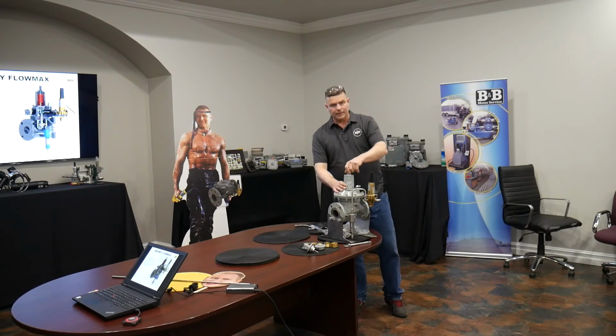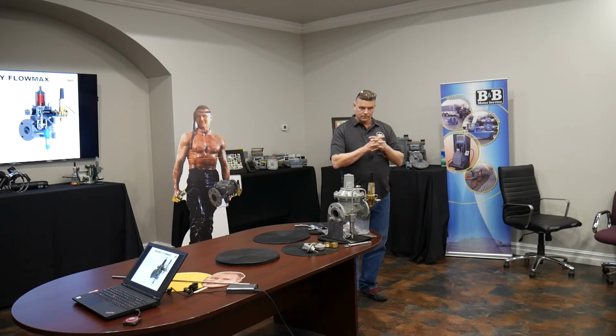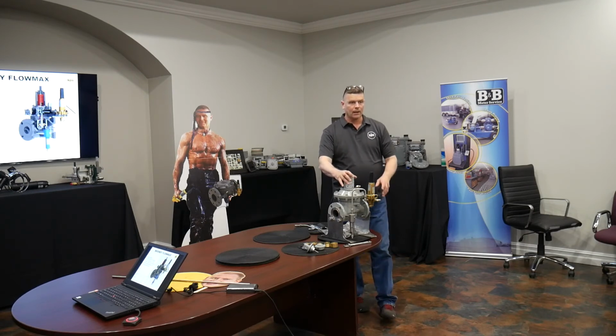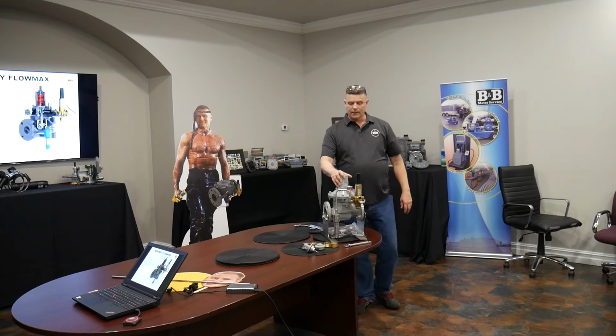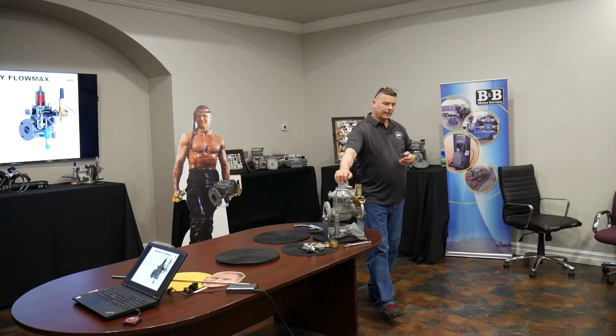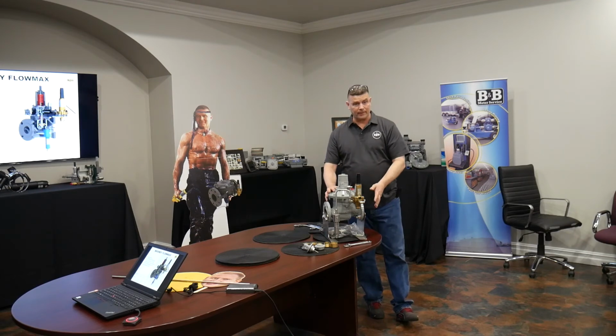Okay. So Jeff, the customer's going to have to supply an addition when we plumb it that way. That dump, I guess, is what you could call it. You need a weld-o-let right there, which is a little unusual. We'll need to tell them ahead of time. That's on the exhaust stack. Typically, there's a regulator or relief, and it needs a downstream dump line. Typically there's a conversation between us and the customer about what it is that needs to happen if they're buying it for a worker monitor, and we tell them how we're going to set it up for them.